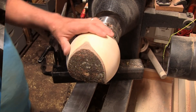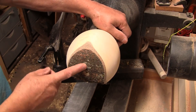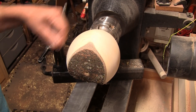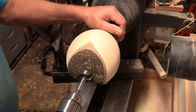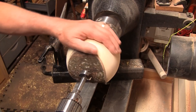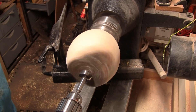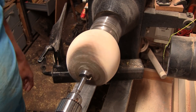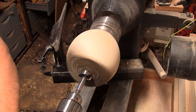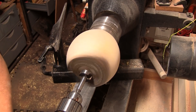I have the outside all sanded up. Thinking about how hard this wood is, I'm going to go ahead and drill it out, and I don't think that's even going to be easy. I'm going to start with maybe an inch and a quarter bit — I didn't even measure it — and then I'll work my way up to probably about a two and an eighth inch or so. I'm not going to make you watch all of that because I do think it's going to be slow.